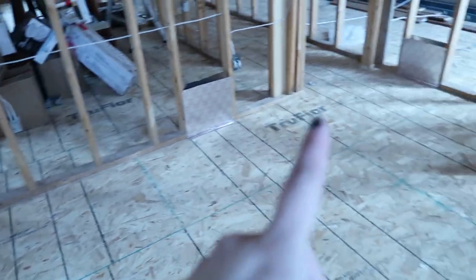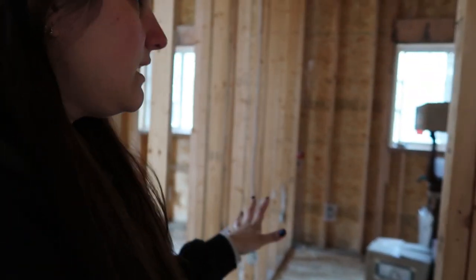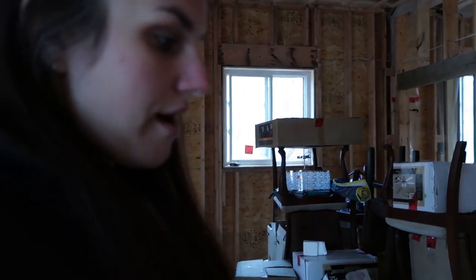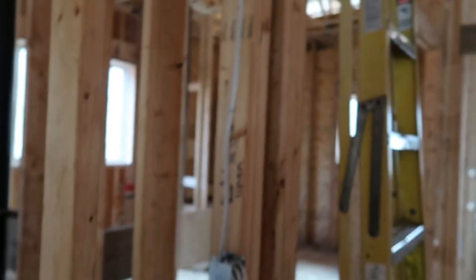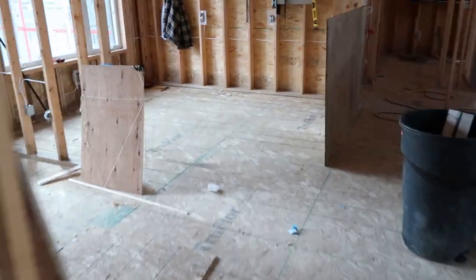This is what you need for your first rough-in inspection — wires in boxes, without the receptacles or switches installed. Moving along, the spare room is done except for the ceiling lights. We have a switch powered for the hallway and wiring run to the first recessed light position. This room has the home run box powering the switches, hallway light, closet light, and the linen closet switch and single light. The room I'm going to be working on today is the main bath. Baby girl's room is not complete yet.